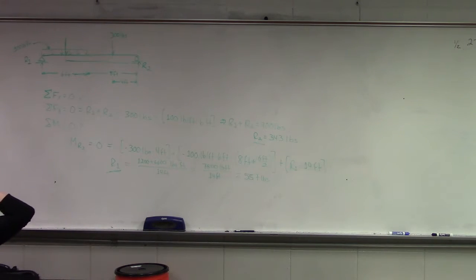Determine a preliminary design for the roof joist, beams, and exterior walls. So all you want us to do is say we want some 2x6s for the exterior walls and some 2x4s for the interior walls. Well, and size the joists. Check your diaphragm, check your shear wall. Is it going to be fine with just an exterior shear wall, or do you need interior shear walls? You would look at the footprint for that, because it's 100 by 50.